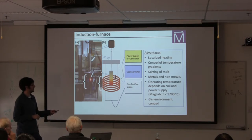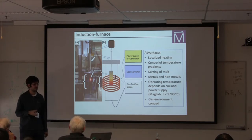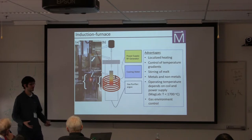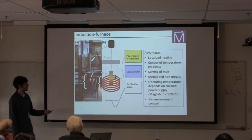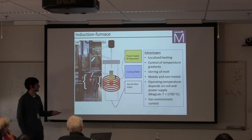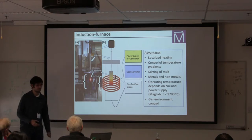There are some advantages to this approach compared to a resistive box furnace or arc furnace. For one thing, you can get very localized heating — depending on the shape of your coil, you can focus the heat down to a pretty small area. You can also get very good control over temperature gradients, making your coil very long to spread the gradient or very short to make it sharp. In some cases you'll get stirring of the melt, which can be very useful. The sample itself doesn't have to be conducting — just the crucible — giving access to a really wide range of materials.